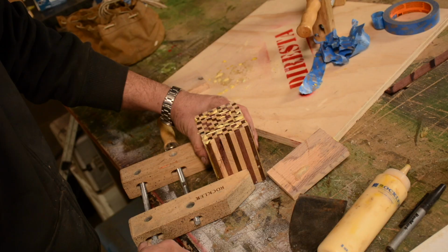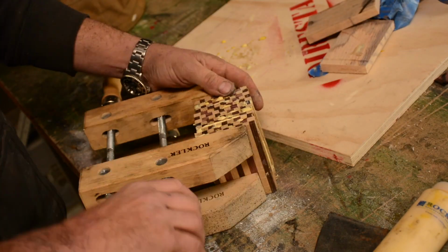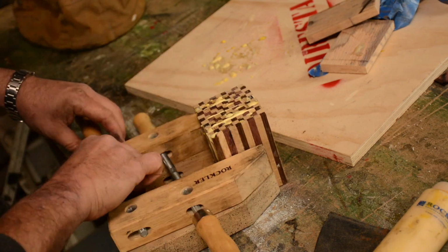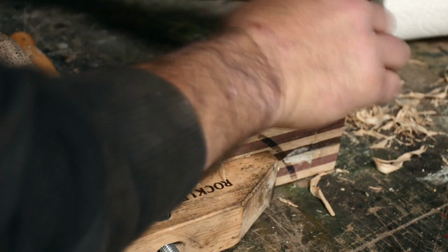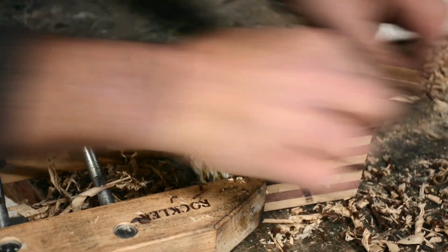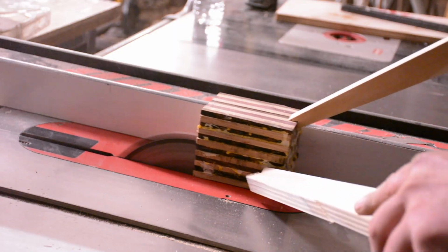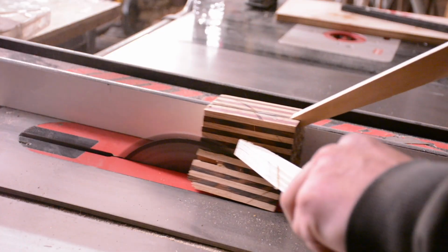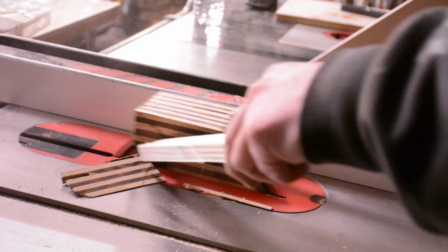I really love these old-timey screw clamps. You can really torque down on your piece. And the trick to that is loosening up that outside one, the one that's furthest away from the work in this picture. By loosening that up, it pivots the jaws really tightly closed. And I don't have a vise in my shop, so you see I'm using these screw clamps. I'm holding the work, and then there's another clamp just off camera holding that clamp to the table.